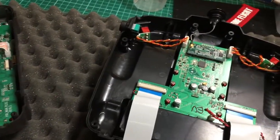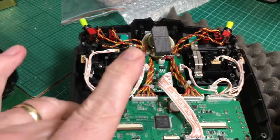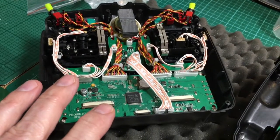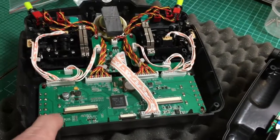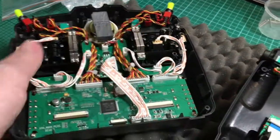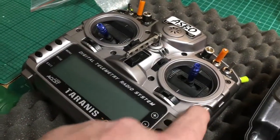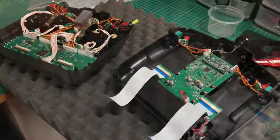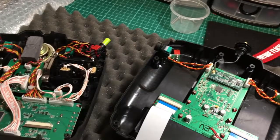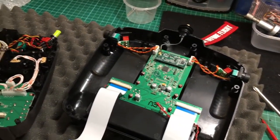Let's put it into the new rear end. I'm not going to rush it. I'm going to take it easy. It looks complicated, but it's not that complicated. Everything is fixed down, the boards screwed down, so there's nothing tricky. The gimbals are released from the front — there's a set of screws on the front if you turn the radio over. You will see these fixing points, so I can slacken them off and take the gimbal out, no problem at all. And this is a tip: mark the top edge of the switches with a bit of pen so you know which way the switches are. You won't have any problems then. Because if it drops on the floor and you put it in upside down and you're wrestling with it, that's when mistakes happen.